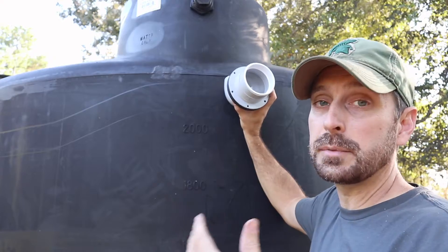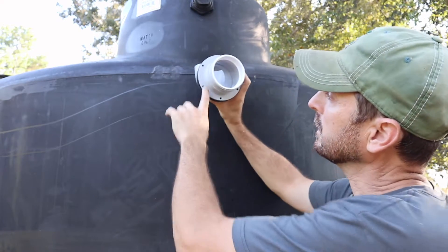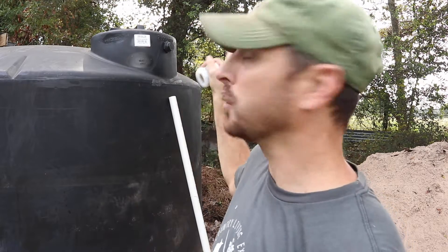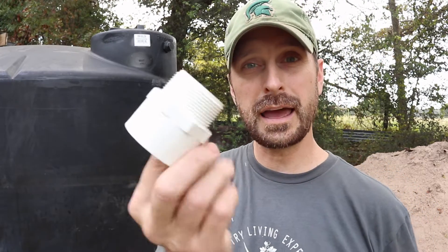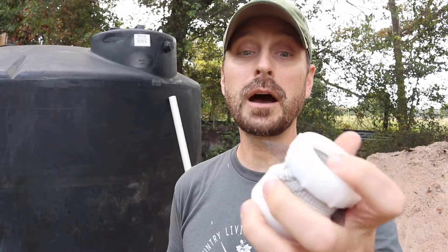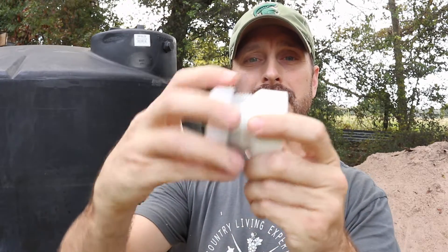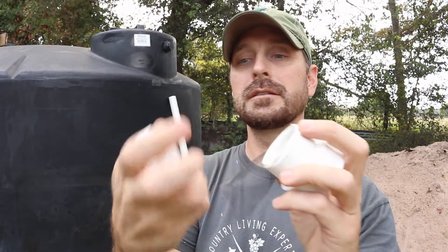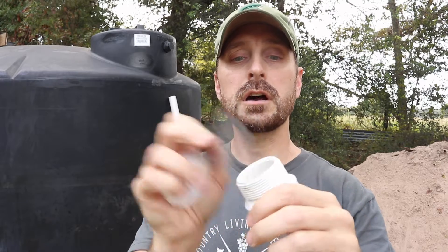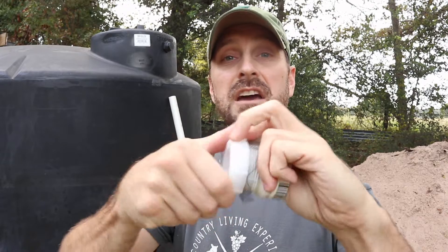The three inch overflow sets directly into a drilled hole in the tank, and the water will gently come out over the top, skim off, and come out. It's secured through screw holes into the side of the tank with a gasket on the inside. For the one and a half inch bulkhead option, you're going to need: some one and a half inch pipe, a one and a half inch male to one and a half inch slip fitting, and a 90 degree one and a half inch elbow. There's also a slip fitting with a cap on the end that gives you the ability to put in a screen — I just cut a little piece of screen to keep out mosquitoes and tighten that cap over the screen. I got this at Home Depot and I'll put all the parts and pieces in the description below.